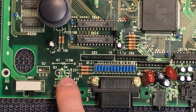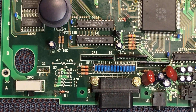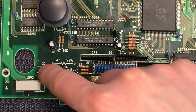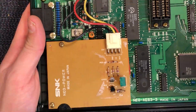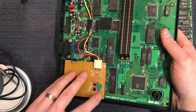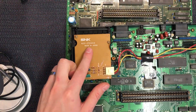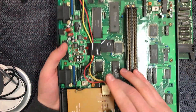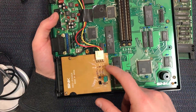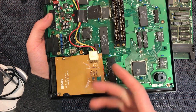The two transistors Q3 and Q4, we don't know what they are. Same with Q2, that big power transistor. I've got an older, different revision that has the daughter board - like a daughter power board, Neo power board - and it also runs off five volts. So we can just go ahead and examine those components and basically order equivalents.